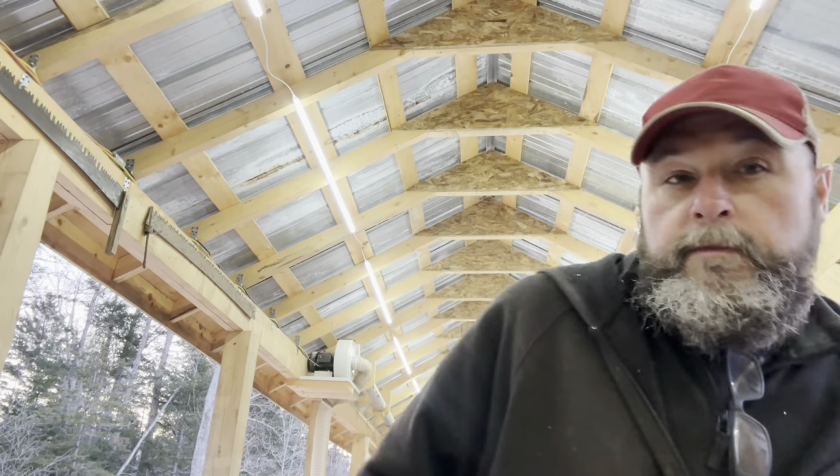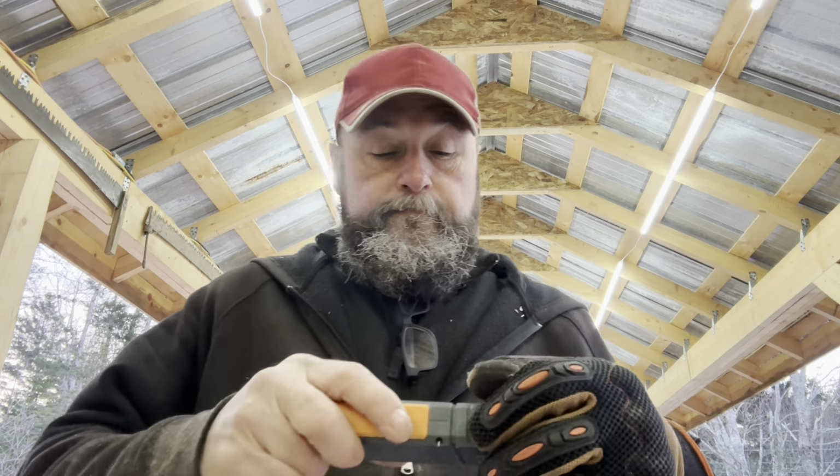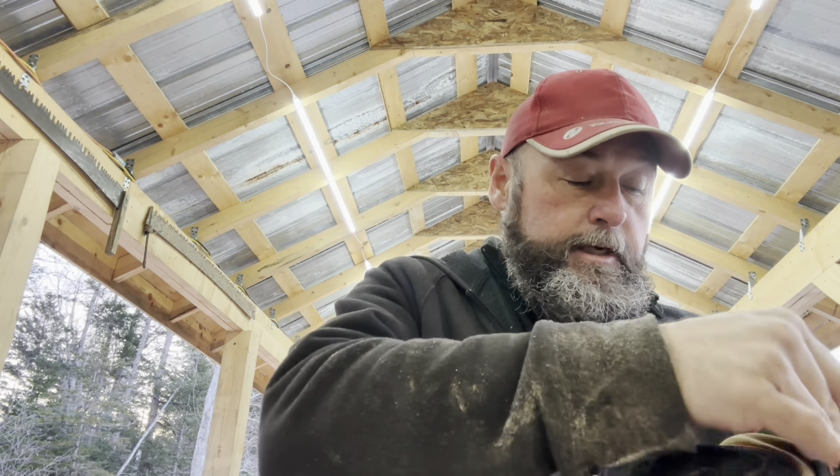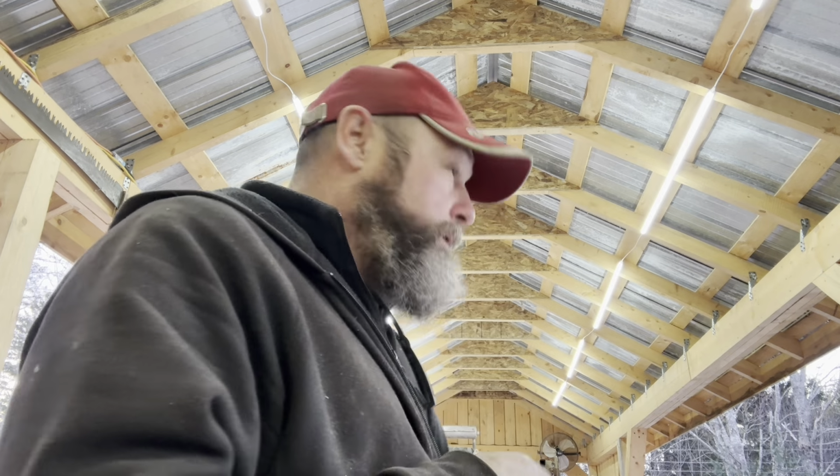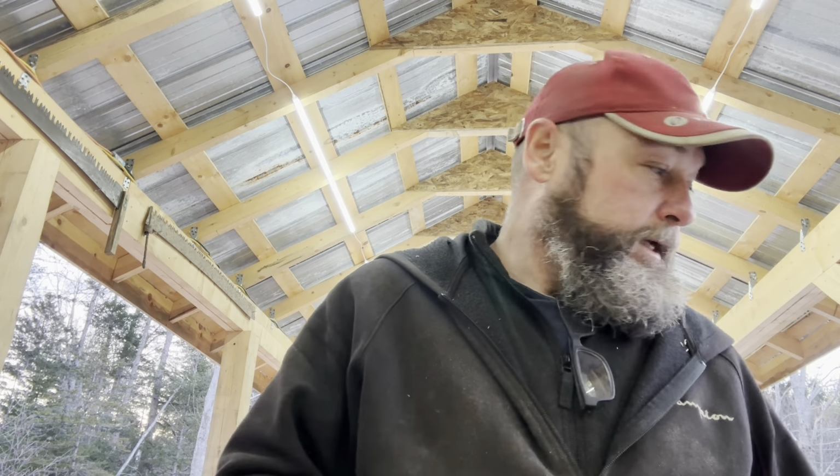I don't sell kiln dried lumber. I sell the rough product, and my end user turns it into whatever it is they want to turn it into. The slabs that I've taken off the jacket boards around these live edge bits are going to be made into stair treads. So I'm going to put those aside, and I'm going to flip this over. I'm going to take one 2¾-inch slab off of that, then flip the whole thing upside down and end up with a 2¾-inch slab at the bottom. It'll make perfect sense, I think, when you see it going.